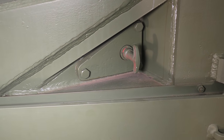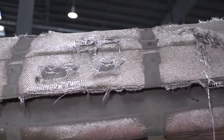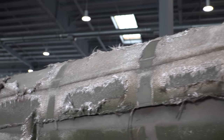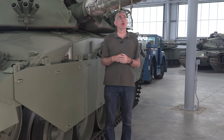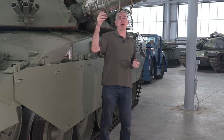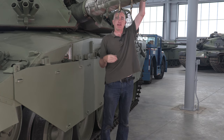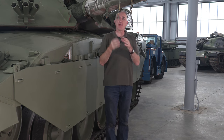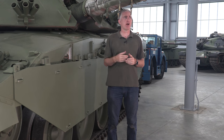There's a fire extinguisher handle here, with one on the far side as well. The gun has a canvas-slash-fiberglass combination gun shroud — it is a thermal sleeve, and I think it's the first tank in these videos to have one. The function is to even out the temperature of the gun itself. For example, if the sun is beating hot and the gun gets hotter — all the metal expands — then it starts to rain, the rain lands on top and contracts the metal there, which means the gun will bow upwards. The thermal shroud is designed to even out the expansion of the gun. There's also the muzzle reference sensor at the end, used for alignment — I'll talk about that inside.